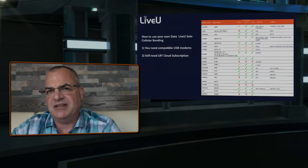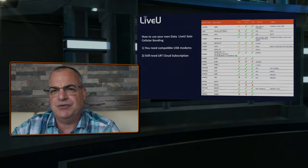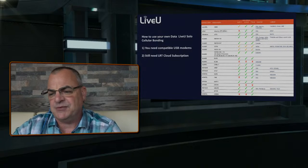The warning I do like to give people is this happens all the time. There are 2 things that are going to delay your streaming. A lot of times we'll get a phone call from somebody that says on a Thursday they want to buy the unit because they're going to do a shoot on Saturday or on Friday. It does take time. First off, if you're streaming to YouTube Live or Facebook, you've got to set up your accounts and be ready for live, because that takes 24 hours on YouTube Live. The modems, and actually doing all the setup of allocating and getting your SIMs connected to the network, can take 24 hours. So you really want to allow yourself time for all of the external services to get locked and loaded.